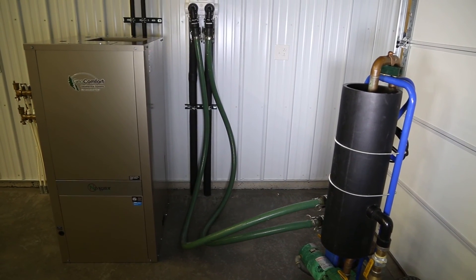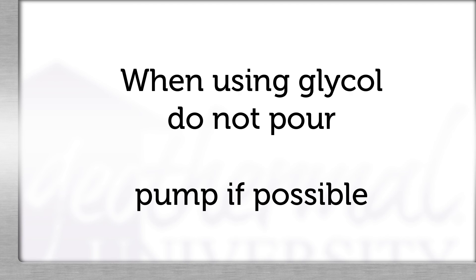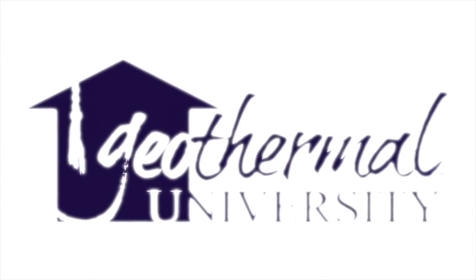A few last suggestions on flushing and purging a loop. For safety purposes, we do not recommend pure alcohol on site — it is highly flammable. We recommend the use of pre-mixed antifreeze. If you are using a glycol when it's cold, you should not pour it because of micro bubbles and foaming issues. It is best to pump the glycol if possible. This is especially important if you are transferring from a large barrel into smaller buckets and then the cart. Your loop and geothermal system are now flushed, purged, and filtered. You are now ready to heat and cool. Thank you for watching Geothermal University.